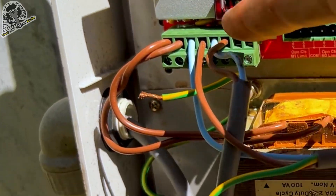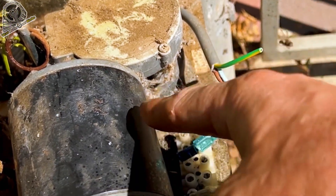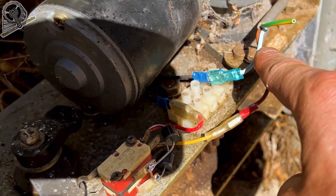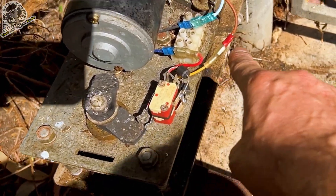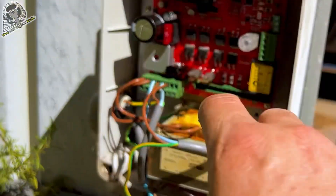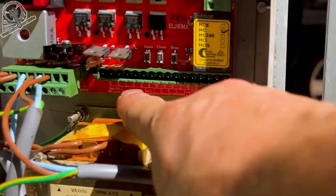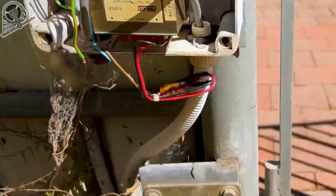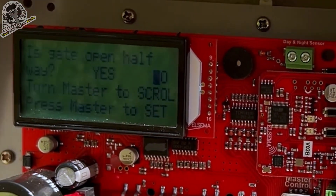The limit switches are in series with the motor. The motor wire comes out, goes through into the motor, comes out of the motor into the limit switches, to the bottom limit switch, and out back up to the control board into the other side. So it's one big continuous loop — through the motor, through the switches, back up. We've got the diode so it can't reverse polarity; that's the board's job. So basically, if you've got five wires plugged into the control board, select 'control card'. If you've got only two wires going to the motor, select 'in series with the motor'.